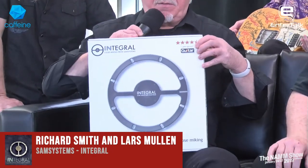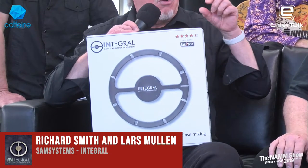What we came up with is a system that does away with all of that. We developed a microphone system which actually sits right in front of the speaker. You can see the holes, which are the fixing points — they match each of the speaker fixings. It's only about three millimeters thick. You undo those bolts, take the speaker off, put this in place, put the speaker back, and it's permanently in the right place every gig.